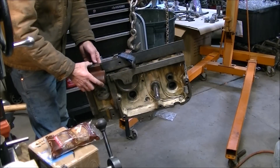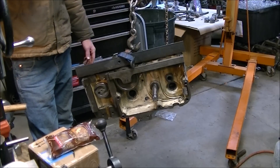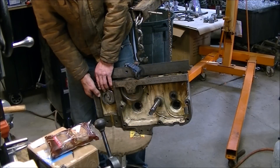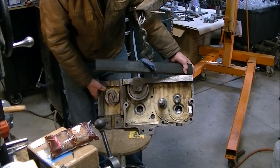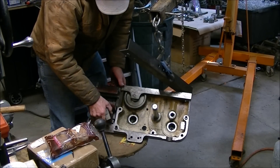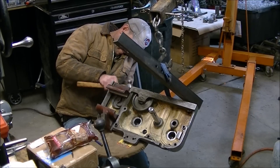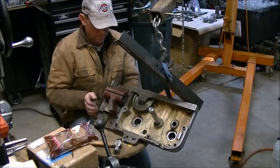My bracket for holding things did not allow me to get the half nuts back in there — one of those "what am I thinking?" moments. I pulled the screw off where the bracket was on and was able to get the half nuts back in where they belong. The taper pin holds the half nut handle onto the shaft that runs the cam that engages and loosens it.